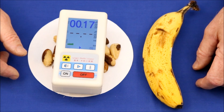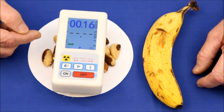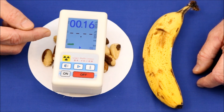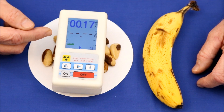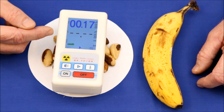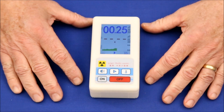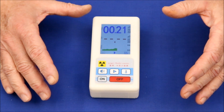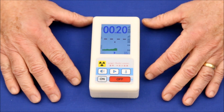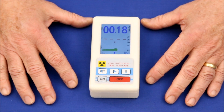What's going on? The problem appears to be that although the manual claims this meter can detect beta radiation, it doesn't seem to be able to do so. Ironically, the manual doesn't mention that it can detect alpha particles, and yet that's what it seems to do best. In spite of these two issues, I found the Weisir BR6 radiation detector to be an interesting device for demonstrating the presence of radioactivity in daily life, and well worth the purchase price.